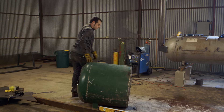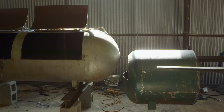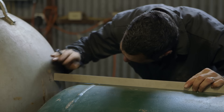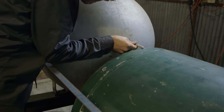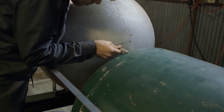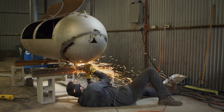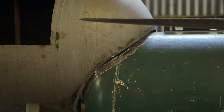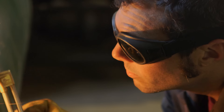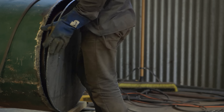I need to get the cooker a little bit higher to make room for the firebox. This is definitely one of the trickier parts of this build — trying to get the firebox onto the cook chamber. There are two spheres coming together, and once I get it kind of set where it's going to stay, I'll start to scribe a line up top, cut it out, and eventually work my way all the way around. Then I'll slide the thing in there, weld it, and it'll actually be on there. Once we get the firebox on, we need to close it off and get started on the firebox door.